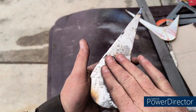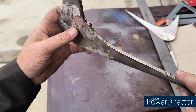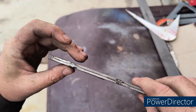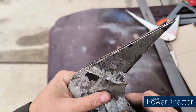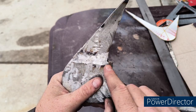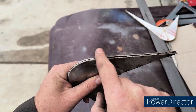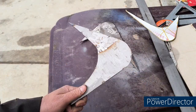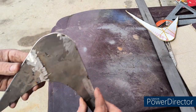So I decided there's no reason they can't be fully welded before this final step, so I fully welded them on both sides and ground them flat. Matched up the bottom piece together and gave it some tacks — just one there and a few right here, so there's just three tacks holding that together. Now I'm just going to go in and shape this all to match each other — probably just cut that little peak out right there and shave that back so it all matches nice. So there we go, there's our gussets. Got both of them, they match each other pretty good.